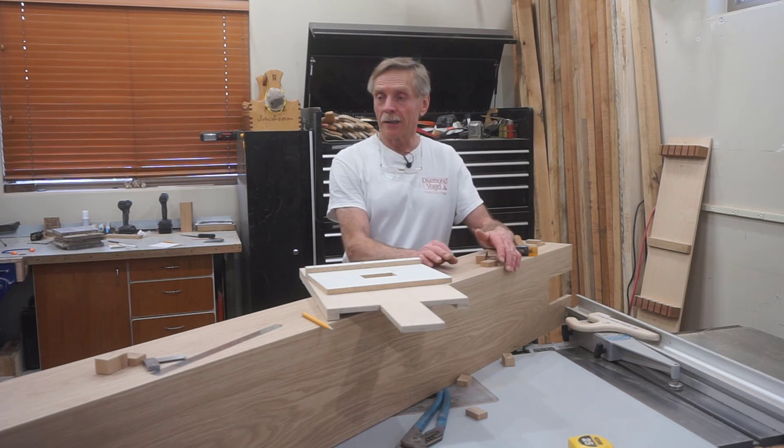Because they're simpler, I'll lay out and cut the two tenons on the two taller beams first. Because this false tenon piece projects beyond the shoulders of the tenon, I just fabricated the sides of these beams and held them back seven inches, which is the length of the tenon. There's no sense gluing that up and doing all that extra fitting and wasting that extra piece of wood only to cut it off.